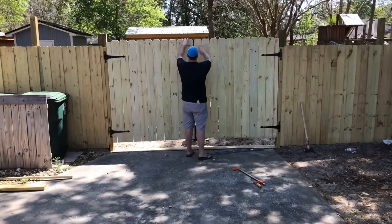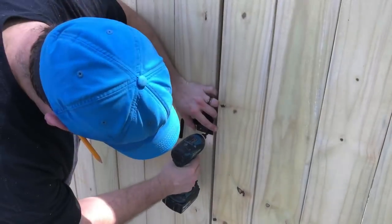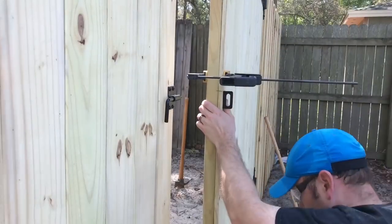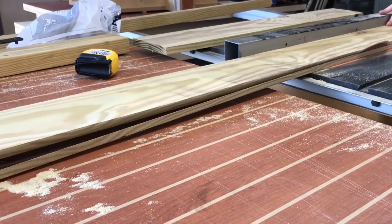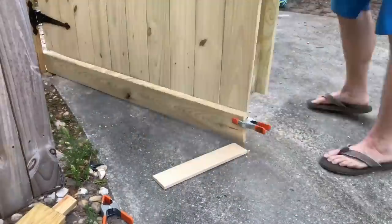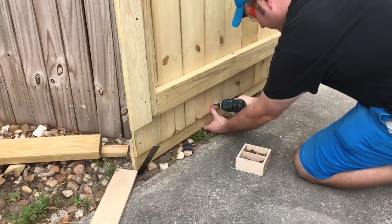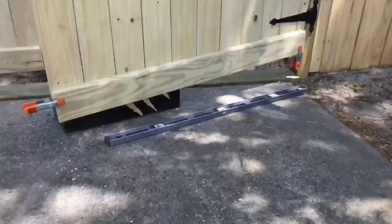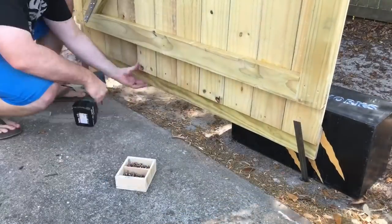This was a pretty cool moment in the project. Now I face the task of how these doors are going to be locked in place. I put a backer board on the left door so that when the right door shuts into it, they stay flush with each other. I go ahead and mount some gate hardware — forgive me, it was very windy that day and the doors kept moving back and forth. Now I make my way back into the shop and cut a 45-degree angle on one of the 1x6s that are going to be the base of the bottom of each gate. You might have been wondering why there was such a big gap between the door and the ground — when you swing the door out, it actually hits the concrete, which is about five inches above the base of the gate, so I had to accommodate that.